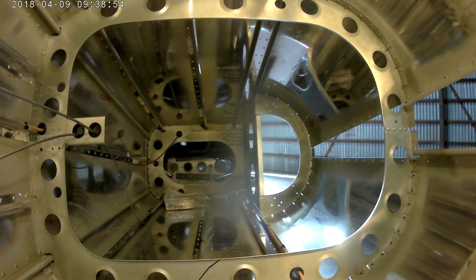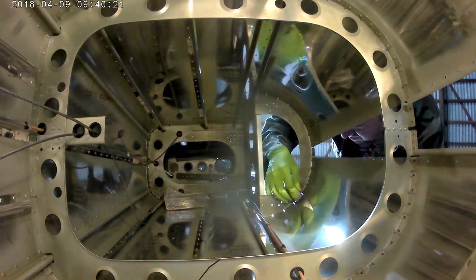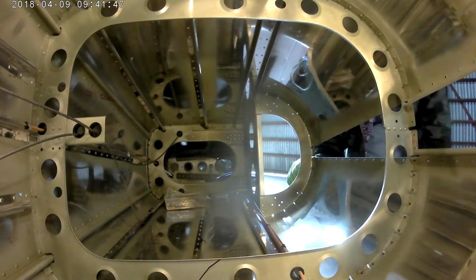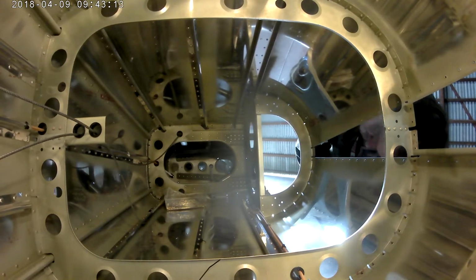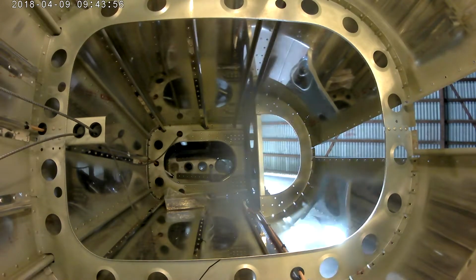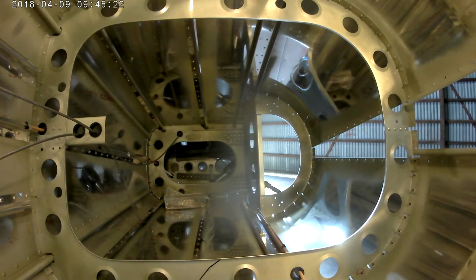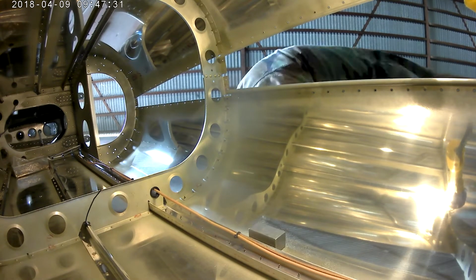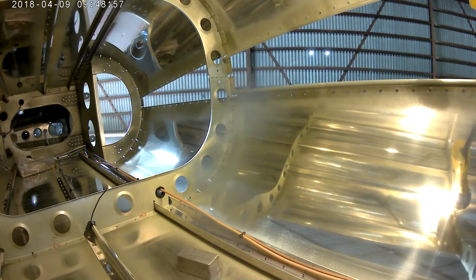And then I use the rivet gun on the inside with the countersink back riveting attachment for the rivet gun. That helps me do it directly on the machine head itself instead of having to use the mushroom head on the outside and the bucking bar on the inside where you can't see it as well. I find the back riveting attachment to be a lot more accurate, and that is why I choose it.